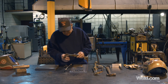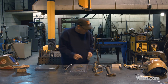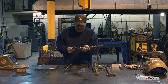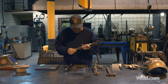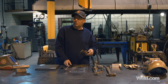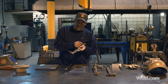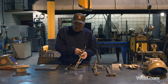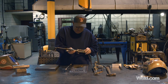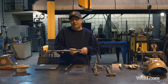I have the pressure set at 5 and 20, and the reason I set them a little low is I want to demonstrate this. At the college, when we're detailing material, time is of the essence, so we tend to use a little bigger torch tip — oversize it so we can get some speed. On three-eighths plate we'll cut with a number one; we get a good preheat and a good bevel. I see a lot of people run extreme pressures, and I've been seeing some good torch hands do amazing work by hand running pressures up real high, but I've personally just never gotten good quality cuts out of it.